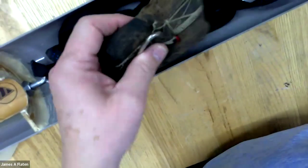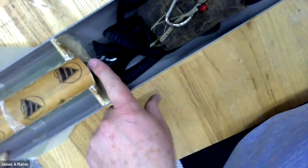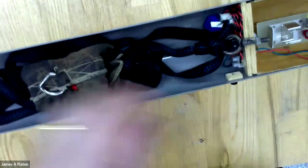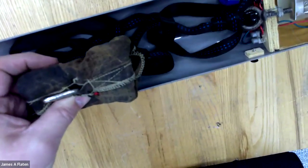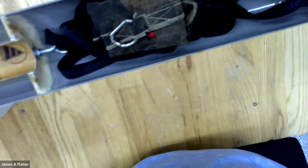One comment about this one, and that is, this one might possibly experience explosions coming from the motor and or explosions coming from the avionics bay. And so it's really important to wrap this parachute up carefully so it can deal with explosions coming from either end. In the case of the other parachute, the explosions only come from below the parachute, and so you can wrap it a little bit less rigorously. You should, of course, wrap it carefully.